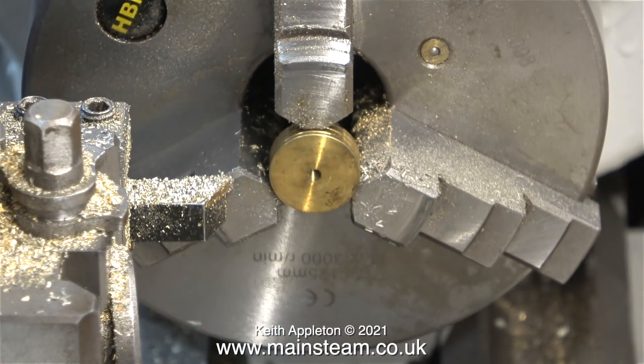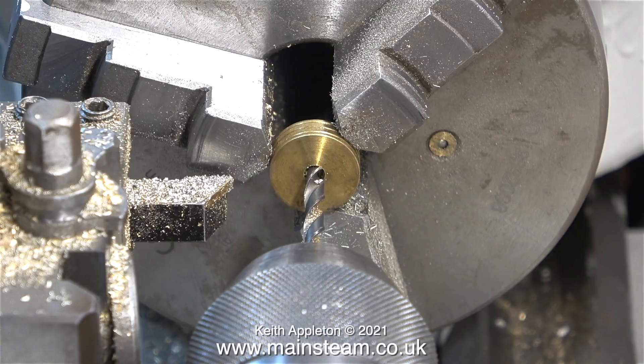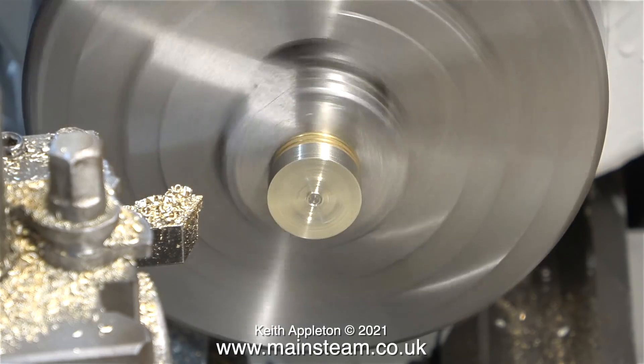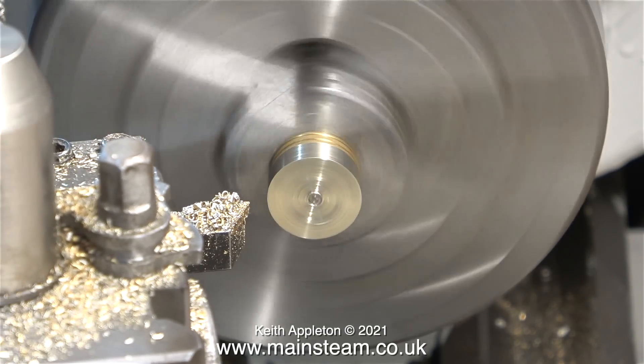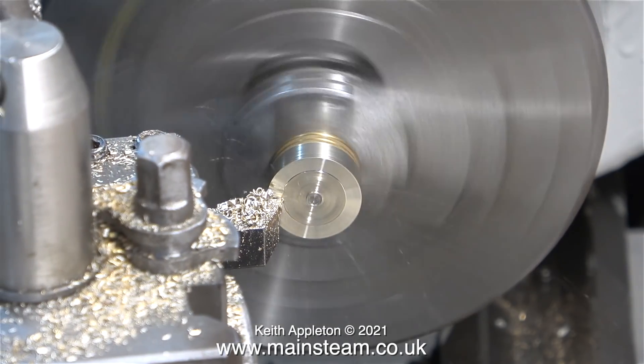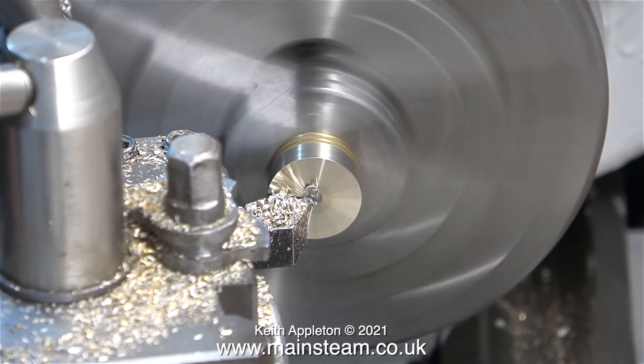In this clip, I've put one of the old pistons in the chuck, centred it by pushing it in gently with the tailstock, and I'm about to drill a hole through the centre of it. Why? I'm making a large washer which will support the piston blank when I clamp the piston rod in the chuck. Luckily, my three-jaw chuck in the old Boxford is quite accurate — none of them are perfect, but it's accurate enough for this job. If you have an accurate collet set that fits in your lathe, now is the time to use it.